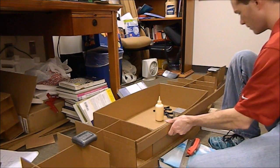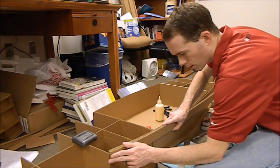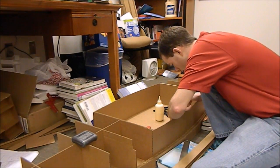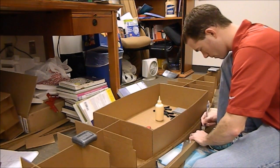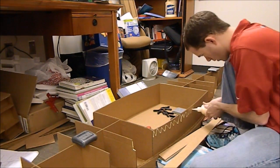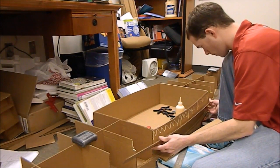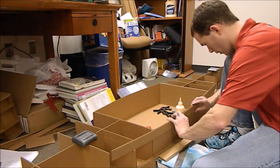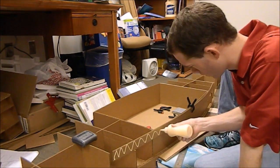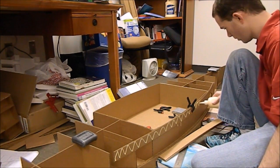I'm going to trace around them so that I know how deep to cut my slot, and that's going to go in there just like so — a nice flush fit. Now I'll start to glue it up. I first want to mark the center point of my hole. These pieces here have already been marked for center lines. I'm using my zigzag pattern because I really want good contact here. I'll use this as a squeegee on the way up to recover some of the glue that drips, and we'll quickly do all four layers and then clamp everything in place.